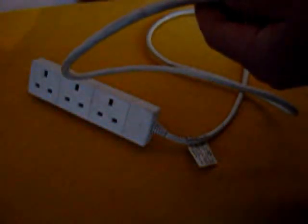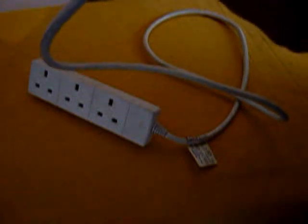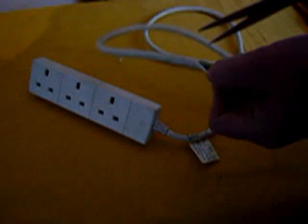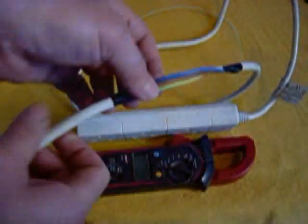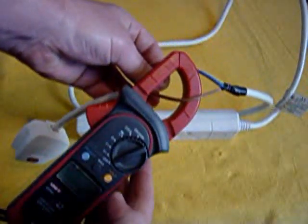We need to carefully — and I mean carefully — expose the conductor. So carefully cut the insulation away to get to it. You don't want to cut through any of your conductors. Once you've made a start, get your scissors — these aren't going to do any damage provided you miss the conductors. Cut plenty off so you can see, so you've got all the conductors exposed. This will be the one we are interested in — the brown, obviously — and we'll simply put the clamp meter round it to take the measurements.